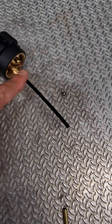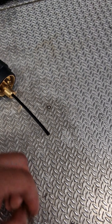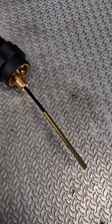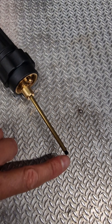You have to install the liner. Here you have the Teflon liner. You have to cut the liner almost touching the rolls, and you have to fit these small holes here. Like this — you fit this pipe. Now this liner should get almost to the rolls.